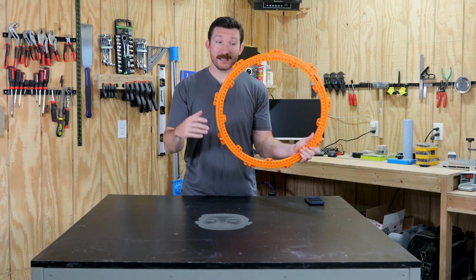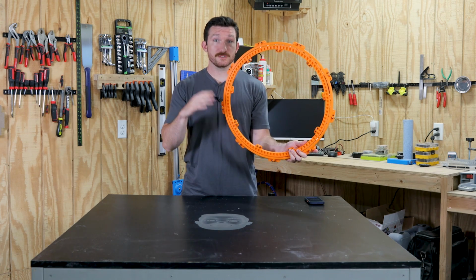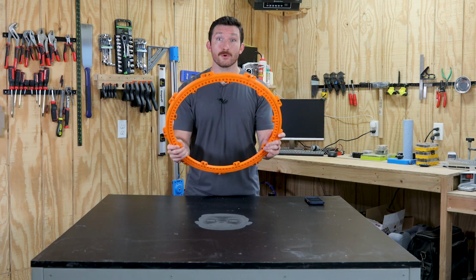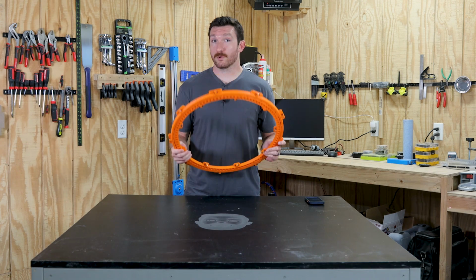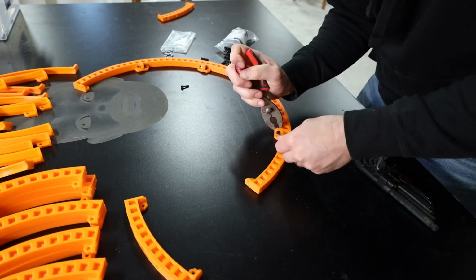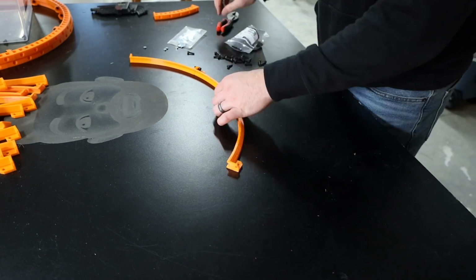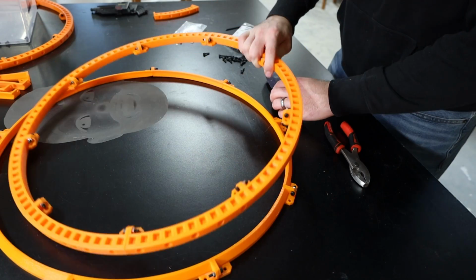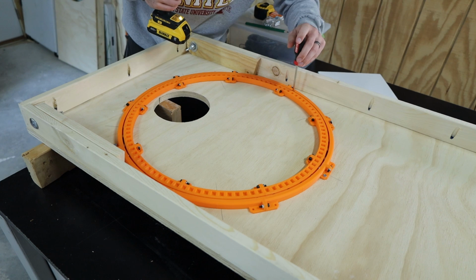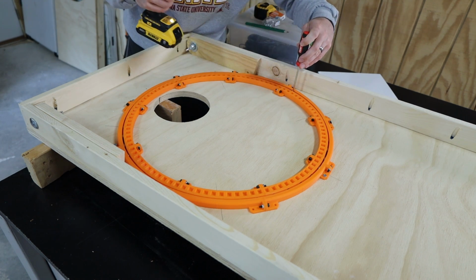Now, designing this bearing ended up being a lot more challenging than I expected, and I ended up going through several iterations and wasting a ton of filament, but finally, after hours of printing, they don't work at all. To make these bearings fit on my printer, I had to break each ring into 9 segments that I then bolted together again. Now, if 3D printers were perfect, this might work, but 3D printers aren't perfect, and there were problems. First, obviously, plastic is flexible, and that made it incredibly hard to get the bearings aligned on the boards while I was installing them.